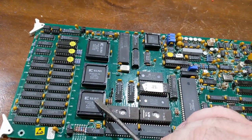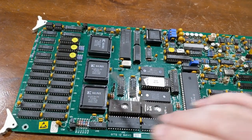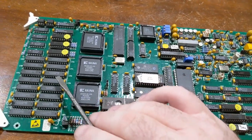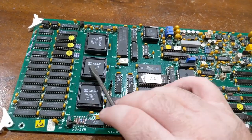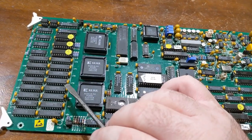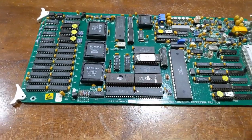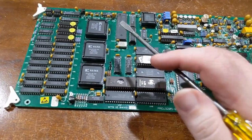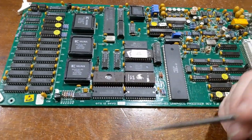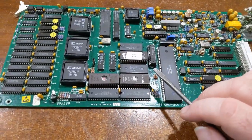And these muxes here, which are FPGAs but they're programmed as muxes, are what isolate the 68K from the RAMDAC, or this memory. So this memory can be piped to go this way, or it can be piped to go this way. And you can do full 16-bit writes in and out of this memory. When you're writing a program to talk to this stuff, you really want to write 16 bits at a time because it'll increase the performance. You can do 8-bit, single pixel writes. Works fine, but guess what? That's 2 bus cycles, and it takes time to execute that because it's got to reach out to memory, read the next instruction to know what to do for the next 8 bits, and then come back.